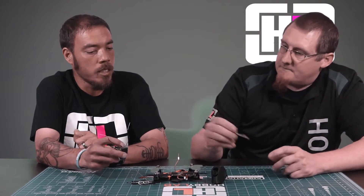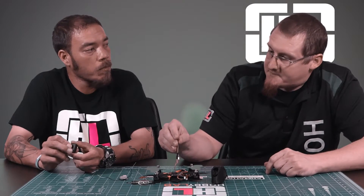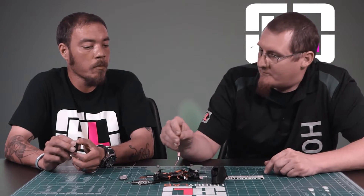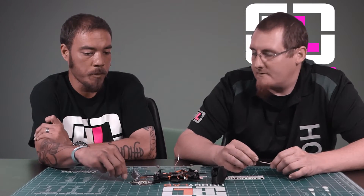Regarding receivers — I use FrSky and it worked with the Pololu just fine. One of the other guys in our group flies Spektrum and runs a satellite receiver, and we could not get it to work. We think it may need a separate 3.3-volt regulator for Spektrum satellite users. Certain receivers may draw too much from the 3.3-volt rail. You can get a 3.3-volt Pololu for about three or four bucks, which might solve it for those guys. So FrSky users need no modification, whereas Spektrum satellite users may need a second VDC supply for the correct voltage — the telemetry receivers may require a bit too much power on that 3.3-volt rail.